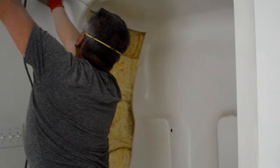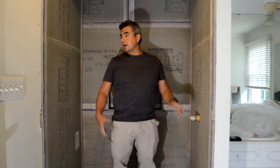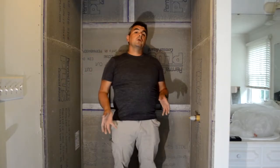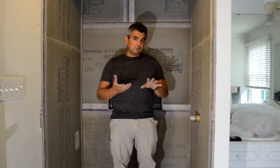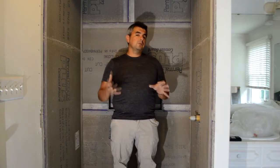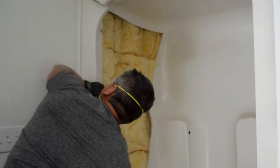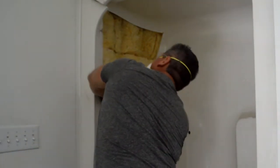And like in this case, we have a whole bunch of wires going on and outlets on the other side, and the duct work over here. So you need to be aware of those things, right? So you need to be careful with that. Make sure that if you can cut off the water of the house, that would be a wise idea, because sometimes the vibration can burst the pipes, especially if they're really old. You don't want to have accidents like I've seen before.